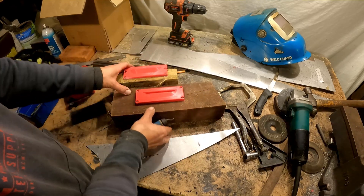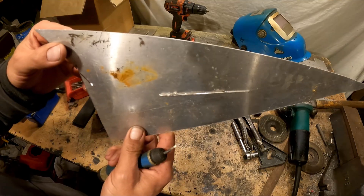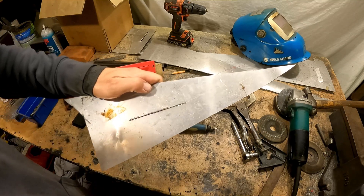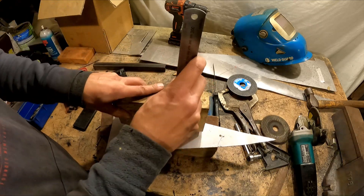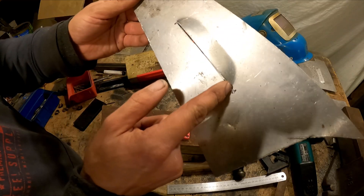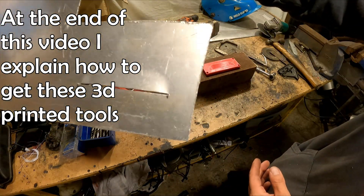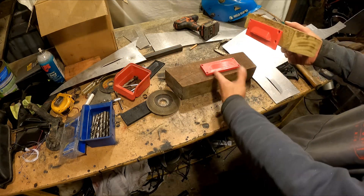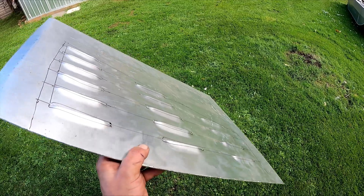So those are the old ones - they've been taken off. Less of an angle on there so I hope it doesn't tear it so much, and screwed them down. Slot in your bit of aluminium. Give it a bit of a clean up with a knife to take the burr off, or just hit it with the old flap disc. Put it hard on one side so you know they're both in the same place. I probably don't need to cut the slot so long - I'll cut it at 100mm next time. That's in 2mm plate. This is only printed at 20% infill so I'm surprised it held up. If you're going to do heaps of these, I'd say print it at 100% if you wanted to do steel or something. There we go - full of louvers.